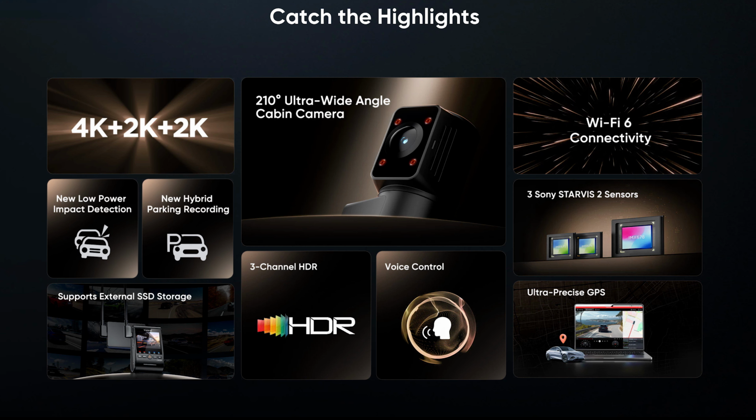And there's a new hybrid parking mode, which takes a traditional parking mode such as time-lapse 1 frame per second, low bit rate, or auto event detection, and then it pairs it with the low power impact detection. And the criteria to switch over is either a timer that you set, or with a brand new hardware kit, the HK6, there's an option of setting a cutover voltage, which will transition to the low power impact detection mode at that particular system voltage.